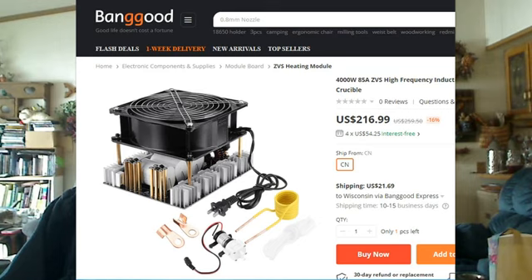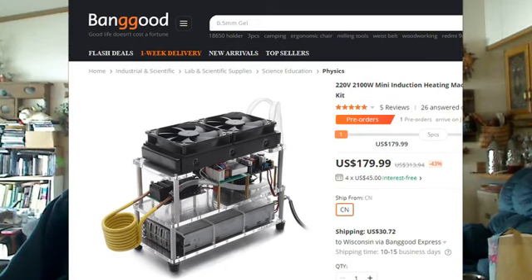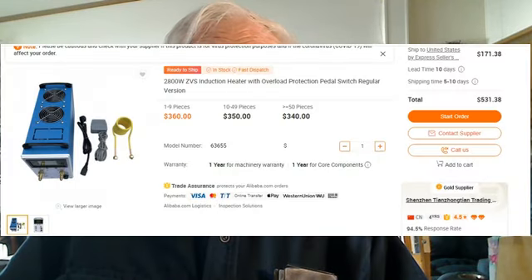Now we fast forward to late 2019 or early 2020. The field has really exploded with many interesting new offerings — sizes up to 4000 watts, 48 volts at 85 amps; have fun finding power supplies to fit, not impossible but you've really got to do some shopping. ZVS units with built-in overcurrent protection and built-in displays. Complete operational systems with all components assembled into one open-sided chassis, some even including a fan-cooled water reservoir. A few manufacturers or sellers have even packaged these same ZVS heaters into nice-looking consoles, which approximately double the price of the open-sided chassis models.